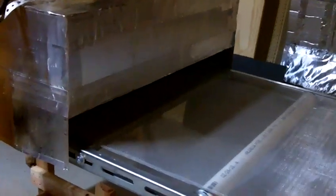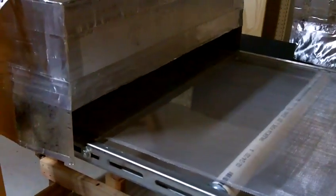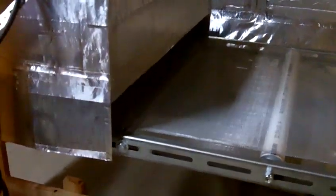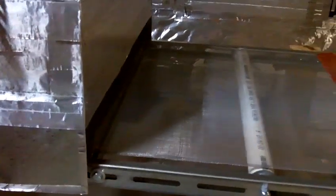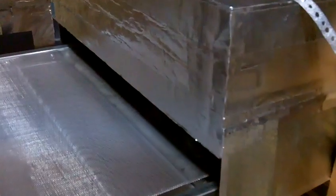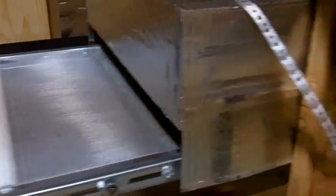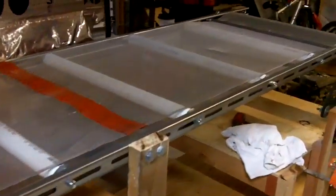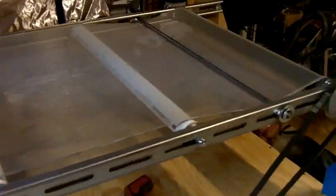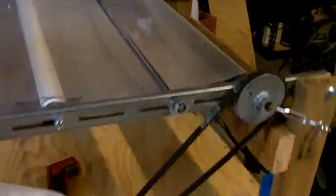That's at about 250 to 350 degrees depending on whether you're doing a water-based t-shirt or a DTG printed t-shirt. The edge of the t-shirt enters here and that same edge has to reach this end in three minutes. With this gearing it's exactly at that right now, and I didn't even have to use a dimmer switch — it's absolutely perfect. I highly recommend going this way.